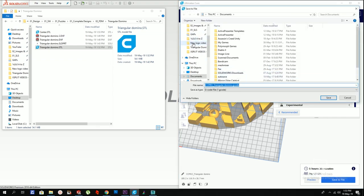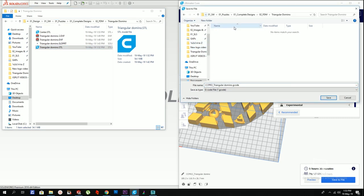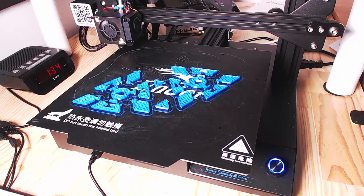The supports on the inside of those parts is not good, so I'm going to risk 75 degrees. There will still be supports here, so that's good. The supports here might not suffice — worst case I'll reprint only the part that might be a problem, which is the center. What antagonizes me is that the software is trying to put support inside the spindle, which is absolutely not necessary. So instead I'm going to reopen my file and print the whole thing support-less, then print this piece separately to avoid catastrophe. I'll save as STL, then save the center separately.